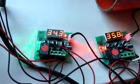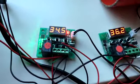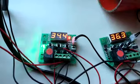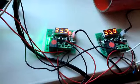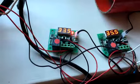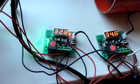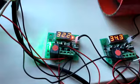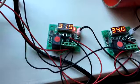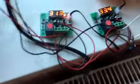Any viewer who's still conscious will have noticed that the right-hand upper stat has now switched off at 36 degrees. This will isolate the heaters, but the alarm will continue until the whole system resets at 21°C. A trace system could also be connected to send an email to the workshop to say that the cylinder now needs inspecting or refilling.